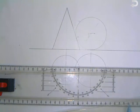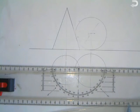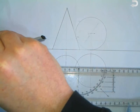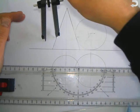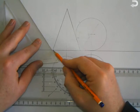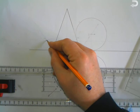What we'll do is find this sphere in elevation when it touches the side of the cone and when it touches the side of the given sphere. To find the touch on the side of the cone, as we've done in all the other questions, we bisect our angle. We'll show it properly on screen with the compass and draw our bisecting line. Our centre point is this point here.